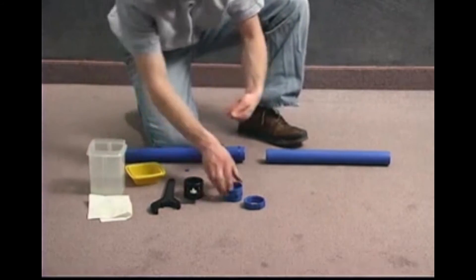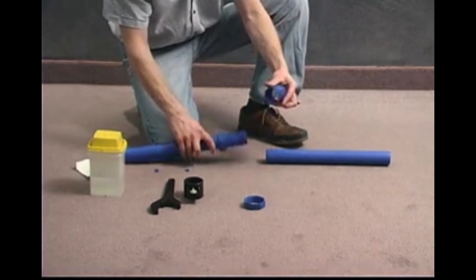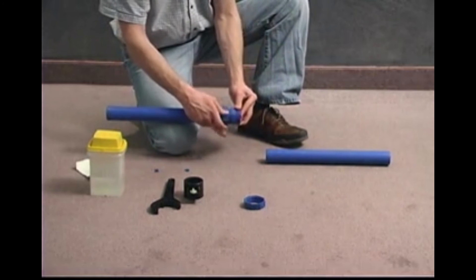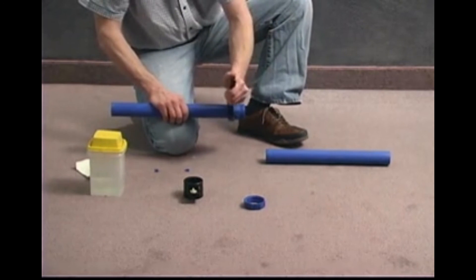Apply an IPEX recommended non-hydrocarbon based lubricant to both the thread and the elastic olive. Then push the pipe squarely into the fitting. The lubrication permits easy take-up of the nuts and allows the pipe with the elastic olive to glide smoothly into position against the fitting sealing area. Hand tighten the nut, then tighten one quarter to one half turn using the spanner wrench.